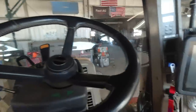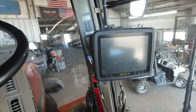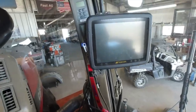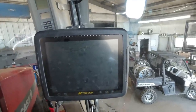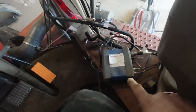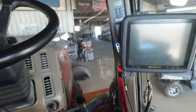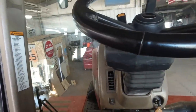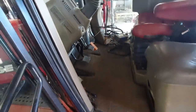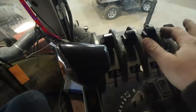Besides that it's pretty much just the standard tractor. This tractor did not come with a factory GPS — it was added after the fact. It's a hydraulic steering system controlled by this Topcon monitor. At one point we were doing a whole bunch with that one monitor: putting liquid fertilizer on with our air drill, steering, mapping, and we even ran our air drill all on that screen too. We have a modem in here for RTK correction, so these tractors are running the most accurate GPS available. It's a luxury cab with leather seats and carpet on the floor.